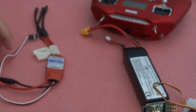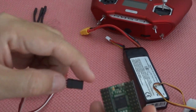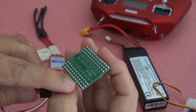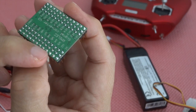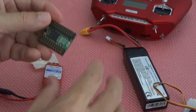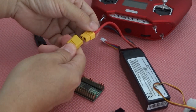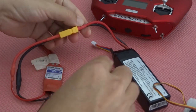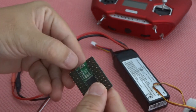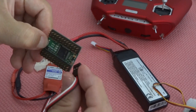To power this, you're going to need 5V. One easy way is to use an ESC with a 5V BEC JR connector, and you just plug it into any of the PWM pins. I'm going to use the first one, which is W1. Make sure the signal is on the inside and the ground is on the outer pin. Plug in your XT60 power supply first, then hold down the setup button, and at the same time plug in the power onto W1.